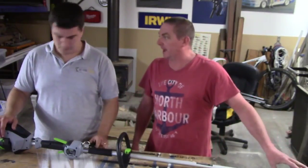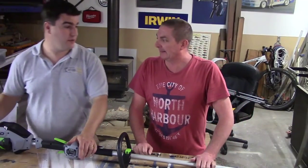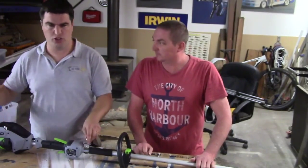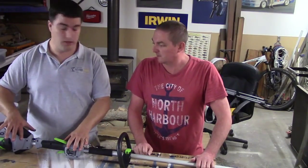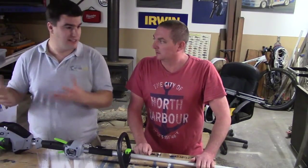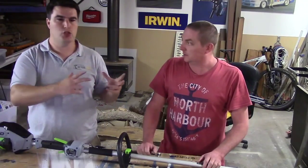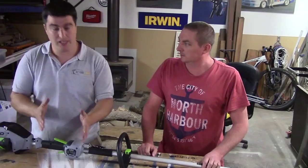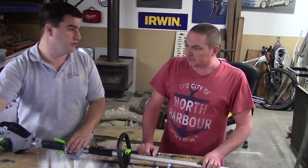It's coming with a 2.5Ah battery now, so about 20% more capacity. The runtime on this is rated to 30 minutes instead of 45 on the original unit. Even though it's brushless and has a bigger battery, the reduced runtime seemed weird — but that 15-inch head is doing so much more work. It's cutting so much faster; the work you'd get done in 30 minutes on this is much more than the 45 minutes on the original.